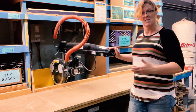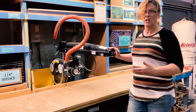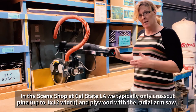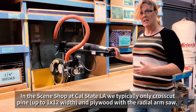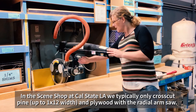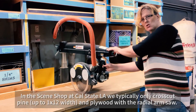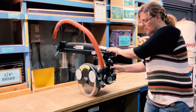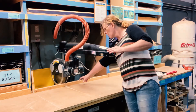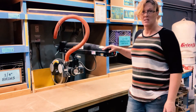Because it's quite complicated and involved, we tend not to do that here. If this was a tool you were using for production of fine woodworking, you might be using all those tasks. But here we're just using it for cross-cutting. The difference between this saw and the miter saw is that it can cut a much wider strip of wood by coming out all the way to the end of the table, but it can also cut your normal 1x3s and other things.